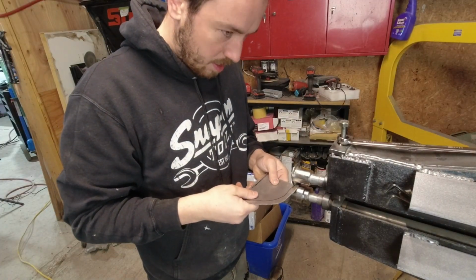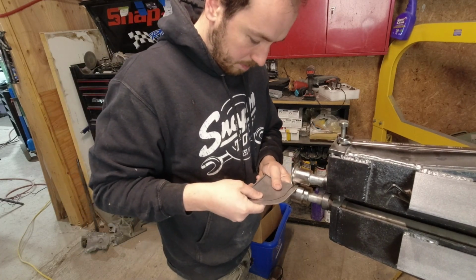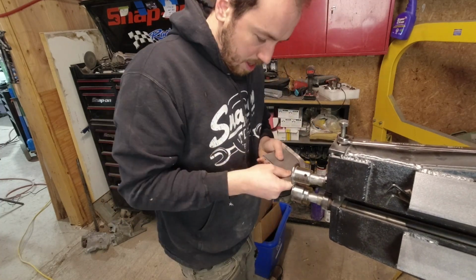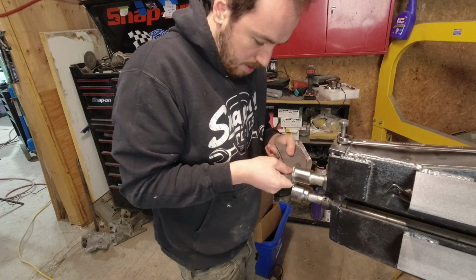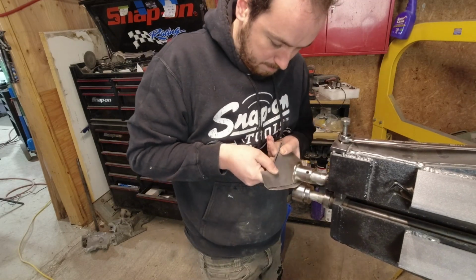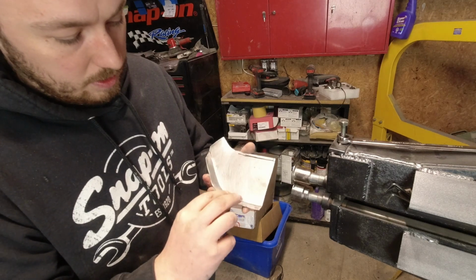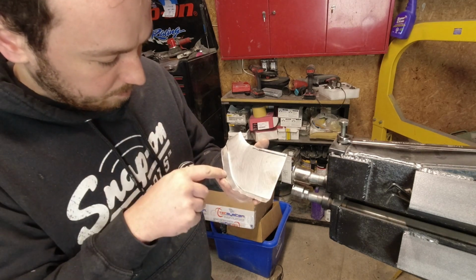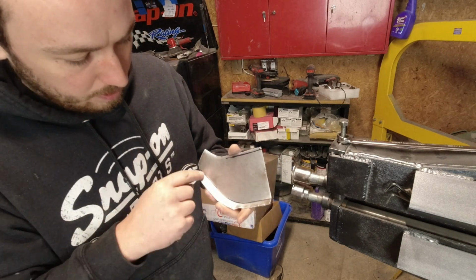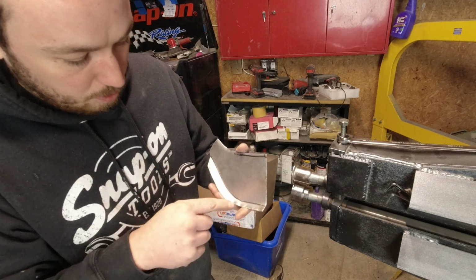We'll see. Get the wrench on there, right? See how well we can tip this on the wrong side here. So you can see it's got some little wrinkles in here that need to be shrunk together. I think this needs to be stretched because I need it to bend around. So I have to stretch here and shrink here. Or maybe if I stretch here, I'll pull that out anyways.